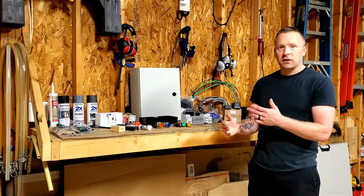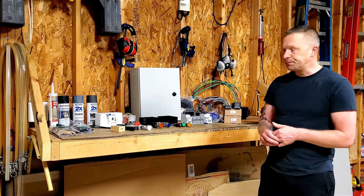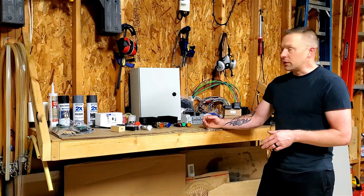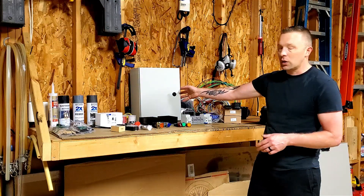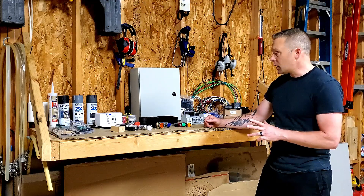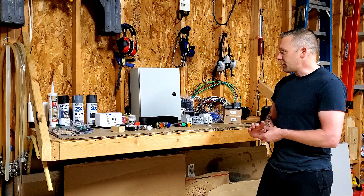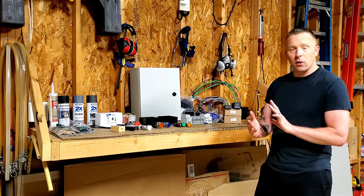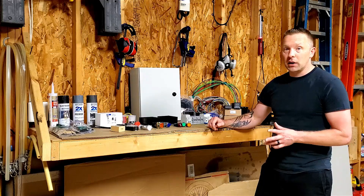There are a lot of pieces to this. I'll show the wall over there where I'm going to mount this panel. I had to go with a much smaller panel than you typically see from other people's builds. This is a 12 by 16 NEMA-rated box — I think it's a NEMA 3, it might be a NEMA 4. I found that it's going to fit where I want. It's not that deep — it's only six inches — but that's what I wanted based on my space. I've done a lot of measurements. It's going to be tight, but it should fit.